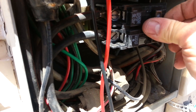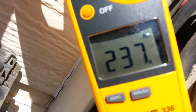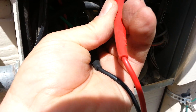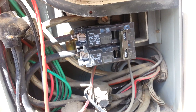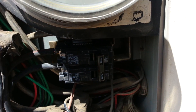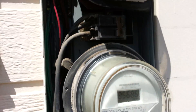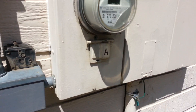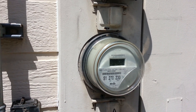We're ready to kick the power on. Check voltage — we're going to have 238, 237. We'll also go to the ground — 117 on the other leg. So it looks like that's good. Then we'll go turn things on inside. That's how I replace the main breaker. The amperage is all good — good to go. We're going to put the lid back on and button it up. Good for another 30, 40 years overall, and we're done.